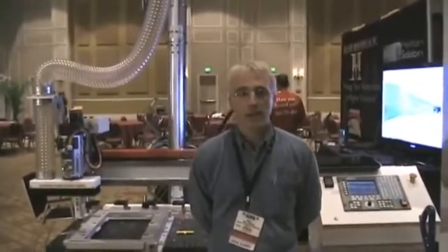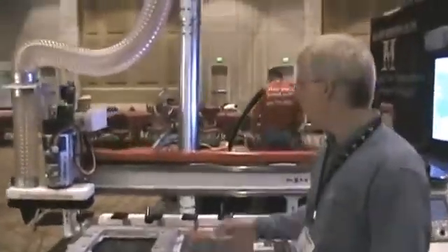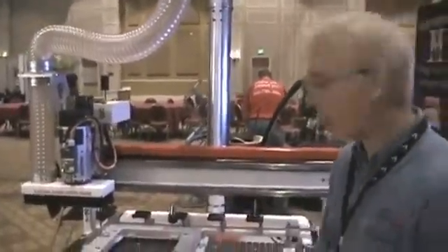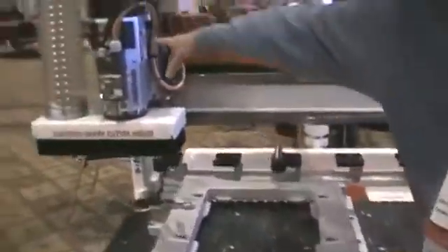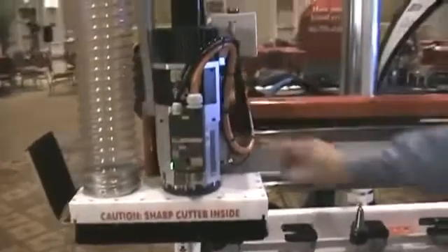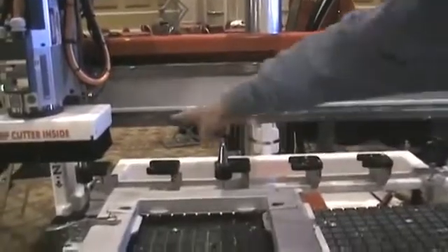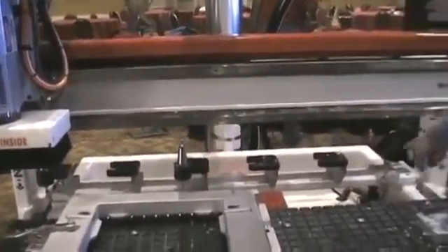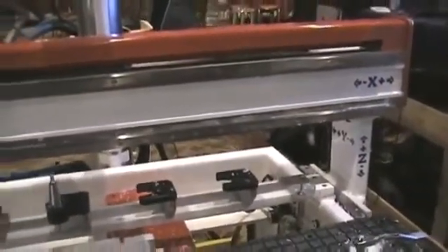Thank you, Tiago. I'd like to take a minute — let's just talk about the machine tool real quick. This is a Patriot OrthoRoute 4x2, so it's got a 4x2 foot table. We've got a 5 horsepower automatic tool change spindle, so we can pick from a selection of tools automatically. This has a 5-position tool rack so we can pick from 5 tools, and it also has an auto tool height sensor for setting our Z zeros.